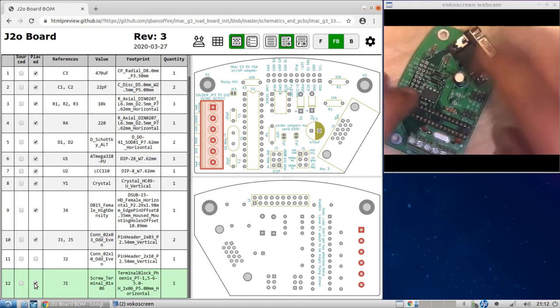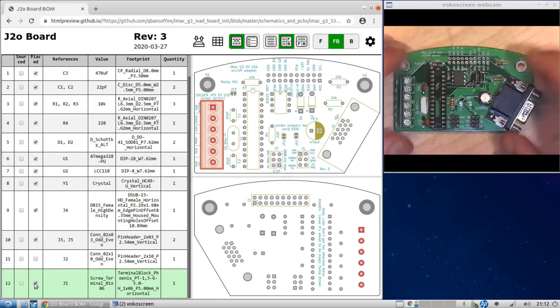You'll see that there are two pads here, and those pads are the same as on here. I'll mouse over them here, JP1 and JP2. Those are open right now, right? If you short circuit these, which means just put a solder blob on them, they will send the EDID information to whatever source you hook it up to, for example your computer, and it will automatically configure itself for this display.